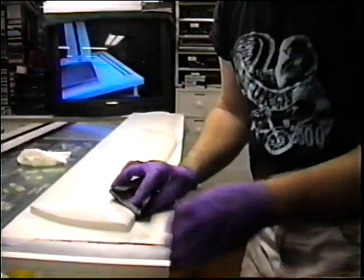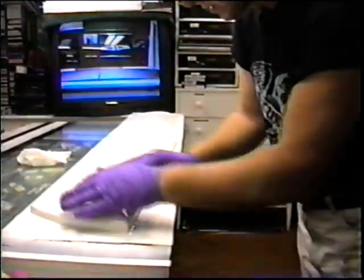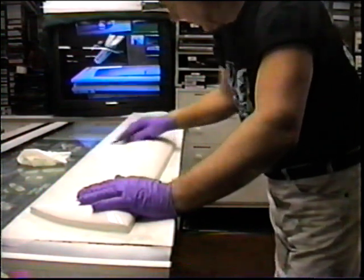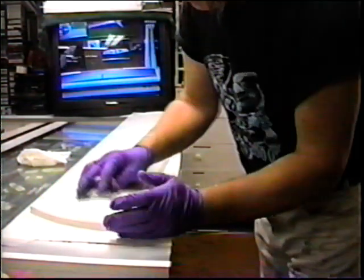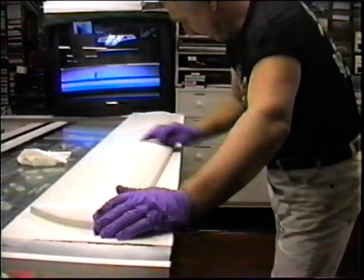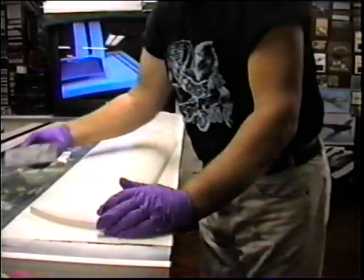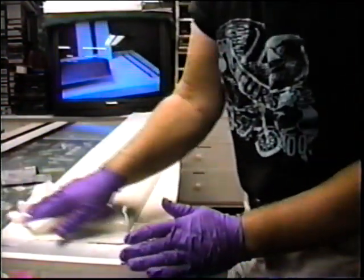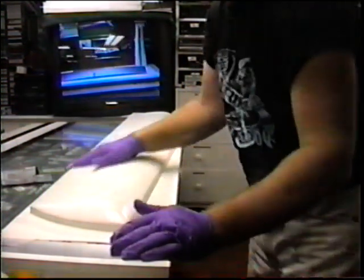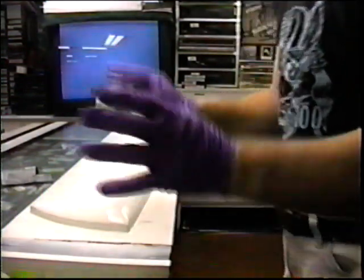A Brodak primer really sands out beautifully. Boy, is that ever the material of choice. And this is just elbow grease, and I won't belabor this, but we're looking at a couple of hours here of sanding, so we'll just try to get this done. And if we go through in a whole lot of spots, it's real easy. We'll just put another coat right on. That looks like it's really coming nice. The 1200 really leaves a nice gloss.